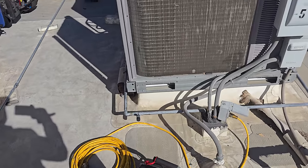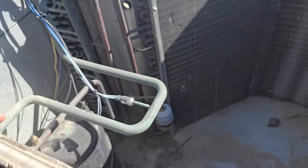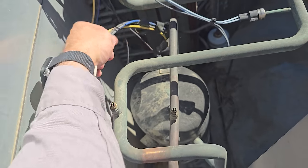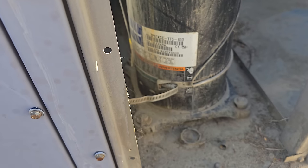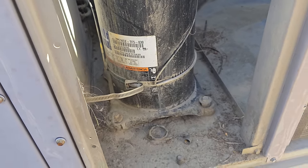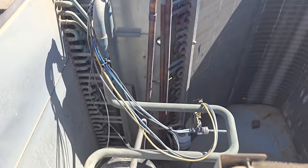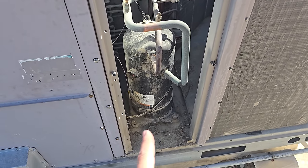Currently vacuuming down the recovery cylinder so we can recover the charge. The condenser's in pretty good shape. We went ahead and pulled the top off the unit because the dryers were always a chore to get to, so this makes it easier. You can see that the technician who diagnosed it pulled the Molex plug off and we just taped it temporarily. We don't know what caused it to go bad, but the replacement compressor I got is a ZP61 — that's correct. This unit is from 2012. I'm hoping it's not an oil-related issue. It has fixed orifice metering devices, so we don't know. We also need to check that crankcase heater.